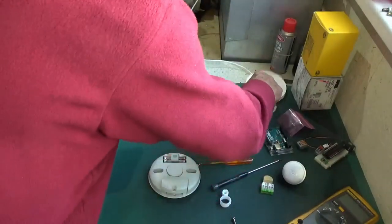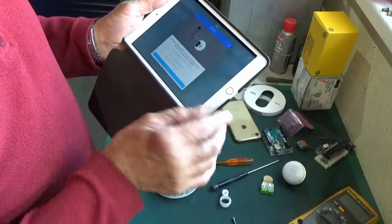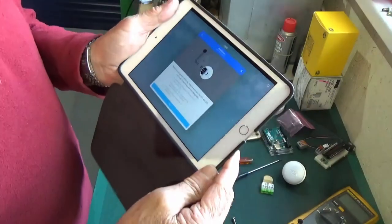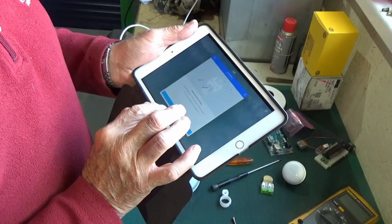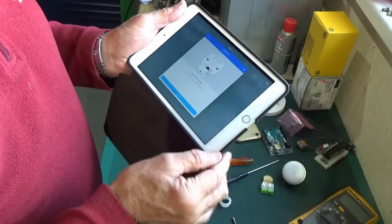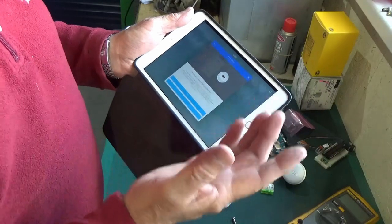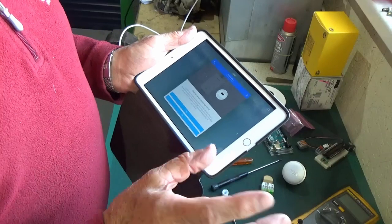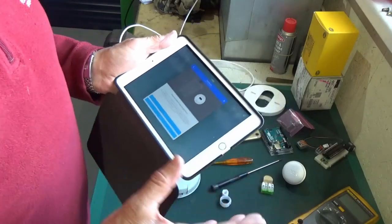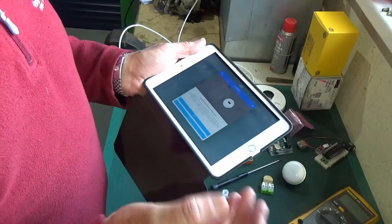Check if you need the optional trim plate - I don't think I will because my cables are coming through the plaster. Next - it's asking me to go into the terminal block with the two wires in OT1 and OT2. Attach the heat link to the base, attach the wire cover back on, attach the cover to the heat link, switch the power back on. Does your system have a programmer? Mine doesn't, but if you did have a separate timer you'd have to set it to be on all the time because all timing controls are now taken over by your Nest E thermostat.